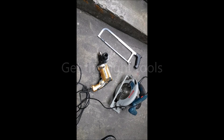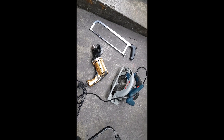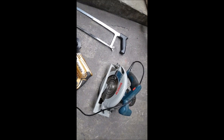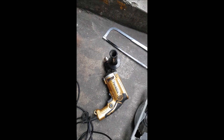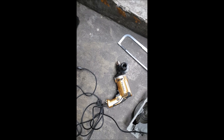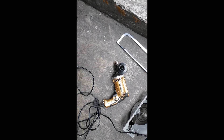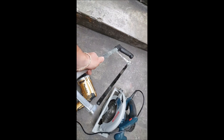To give you an overview of the tools we used: we used the Bosch saw to cut the angles and to bevel the struts. We had two drills — one was battery-powered, which was good because we didn't have to drag a cord around — to drill holes for the bolts and to screw the struts together. We used the handsaw to shorten the struts to the lengths we needed.